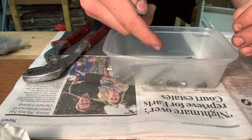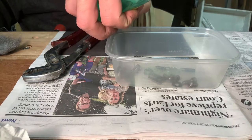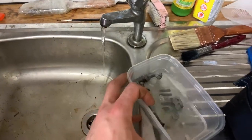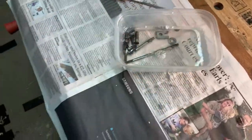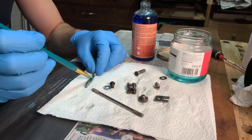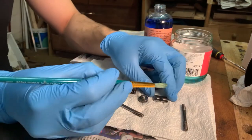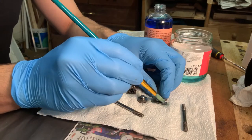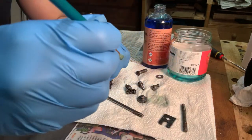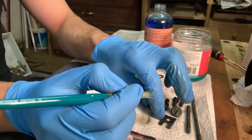All the small parts then got dressed on the wire wheel off camera. Here I'm using soap and water to degrease these components — I want to remove all of the oil and gunk and surface grime that might still be on them. Because now I'm going to blue them. Bluing is a process where you oxidize the surface of the metal chemically, and what this does is create a thin barrier to any rust forming. It's a really effective treatment — actually the first time I'm doing this. I was super pleased with how these parts turned out. It's not the most hard-wearing finish, so if you do this on something with a lot of wear or usage it can rub off really quickly, but for these small machined components it's absolutely fine.